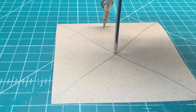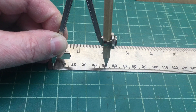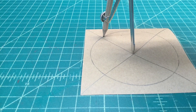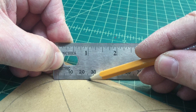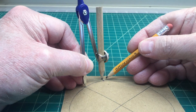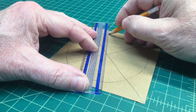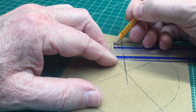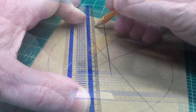I don't need to look at the full diameter — I'm working with the radius, so I split 103 by two. Using a compass, I drew everything out on the paper. The second part of the formula — 25 millimeters — is used to determine the angle of the cut. I measured out 25 millimeters from my known location using a ruler and compass, then connected that point back down to the center, which theoretically becomes your cut line. I moved it back over to allow an overlap for a glue location where the cone attaches.